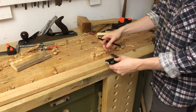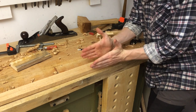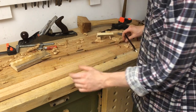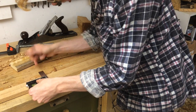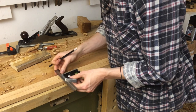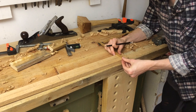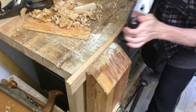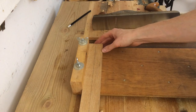Now that I have my centerline I can use that to square up the ends and also create two parallel spots on the part that will become the handle. I'm going to measure up to the base of the blade — that will be the crossguard, the handle, and the pommel — and strike a line square across. I have 48 millimeters there, so I'm going to mark 24 to either side, and planing that away should leave two parallel edges in line with the center of the blade.